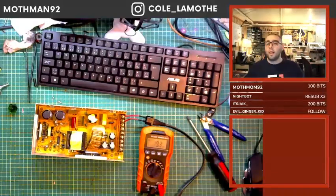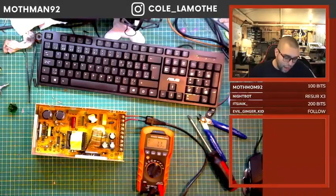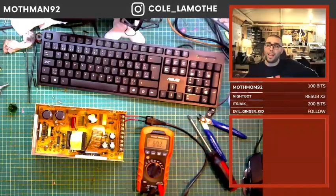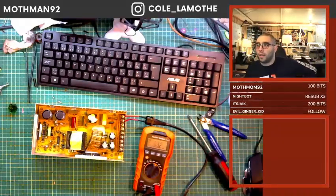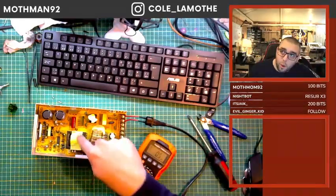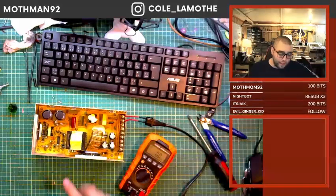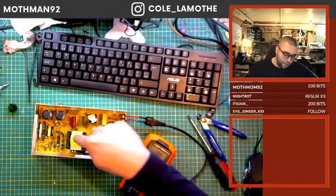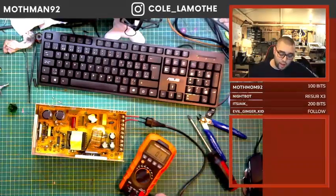Now, one thing I will say. For one, if you do not know what you are touching, do not stick your finger into a plugged-in appliance. Two, if you do have to, one thing that you can't see is that I actually have my other hand pulled back, so that I'm touching with one finger of one hand in a context where my other hand can't get anywhere near that device. If I drop something, I'm only going to make contact with one hand. That is really important when you're working with these kinds of devices, because if I get zapped from this finger to this finger, say I'm touching here and my knuckle touches the base, we've already established there is 60 volts between that earth and these leads.